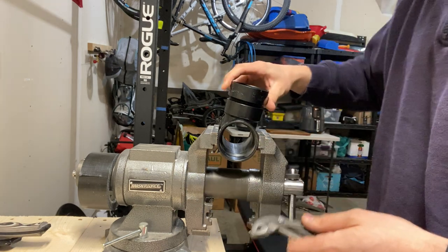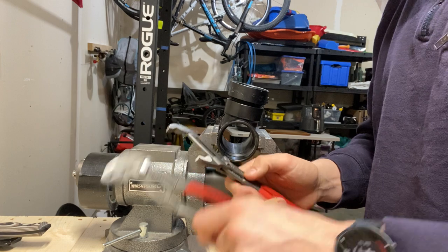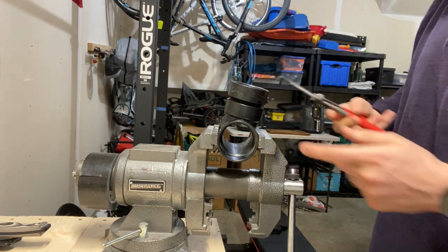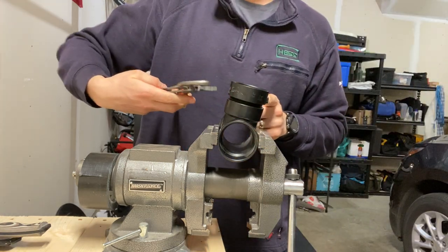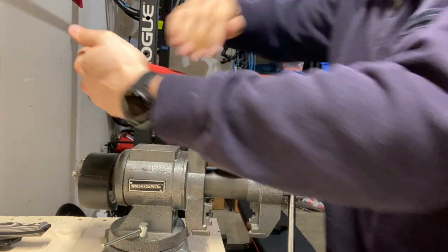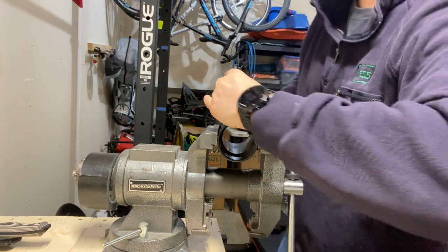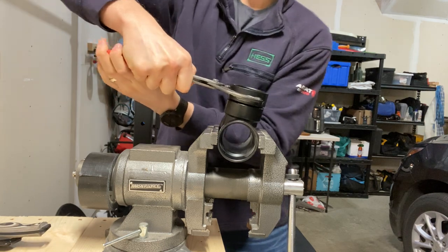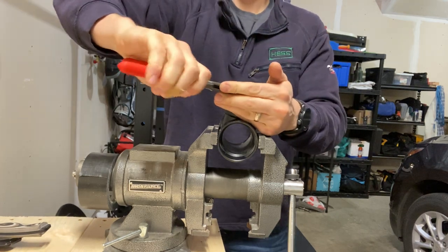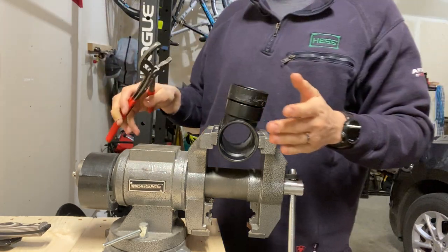Let's look at what you gain with the 250s — they cost the same as the 180s but you get a lot more torque. You don't really get that much bigger fitting capacity though. Once again the nubbin is over here, so going straight on, if I dig in I can get it to bite. I can one-hand it like I was showing before. This is the upper limit of these guys, and the 180s pretty much do what the 250s do with less torque — unless you're talking about bolts, that's a different story, but for pipe it's the same.